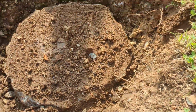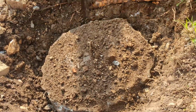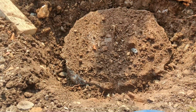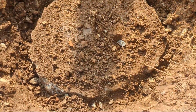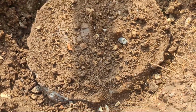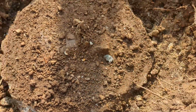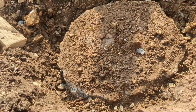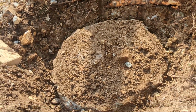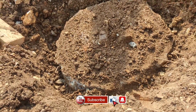Alright, I know I'm going to irritate some people, but here I am replacing the umpteenth 4x4 fence post. Now I'm digging this thing out. Got concrete around it, but do you notice where it broke off? Right here. It always rots off, breaks off right there. Then either you put the post in a separate location, or you had to go back in the same place and pull, and like I am here, having to pull the concrete out.